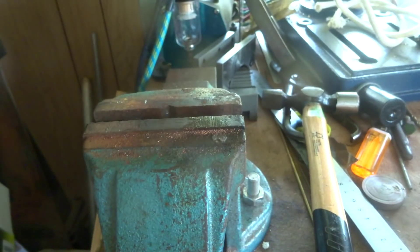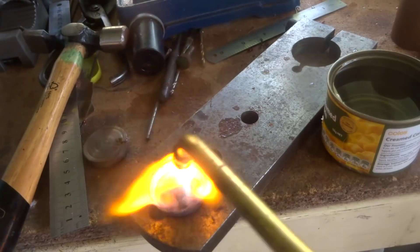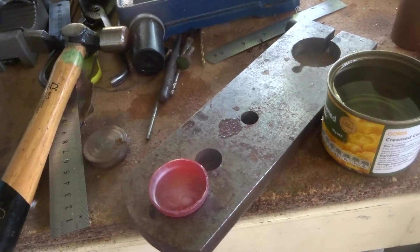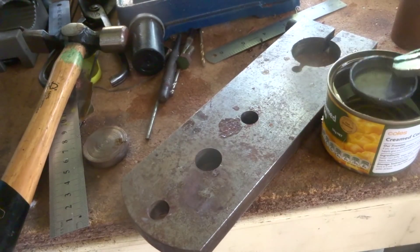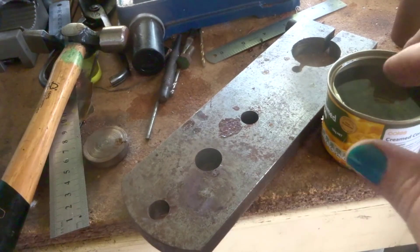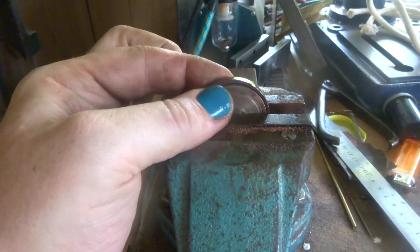Look, that's very close to going in there. And probably if you gave it a tap in that way it would go in, but we don't want to distort it. So we're going to tap it a bit more. Time to anneal it again. If we look we can see it closing up there nicely — no more gap.